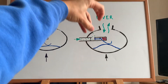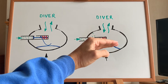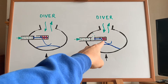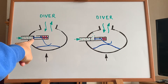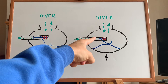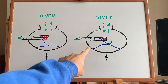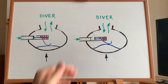As the diver takes that gas out and the pressure drops, it's going to make the diaphragm start to flex inwards — or upwards, depending on how you're viewing this. As it starts to flex, you can see it's pushing on the lever. As it pushes that lever up, internally it's pulling that stopper back — so it's in a closed position, but when the lever flexes up it pulls the stopper back and it's now in an open position. This allows the intermediate pressure gas to start to leak out and into this chamber, which is what the diver is actually consuming and inhaling. As long as the diver is inhaling, it's going to stay in this position: diaphragm flexed in, lever pushed up, stopper open, and gas leaking into the chamber.